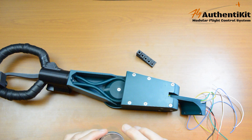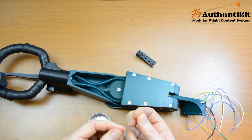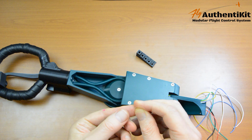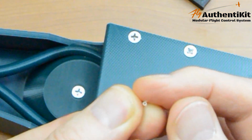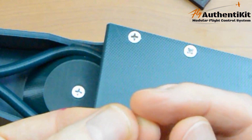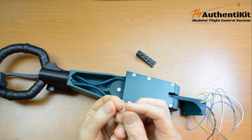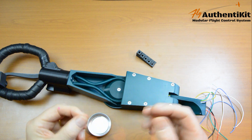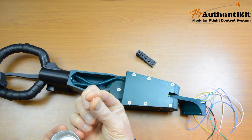That's one thing. Second thing, these tiny little ferrules, they're not all created equal. This is a good one. It's very cleanly cut. I mean, no doubt it's a long tube and they just chop little pieces off. Nice and clean. So when you're threading some wire through there, that's fine, goes great. But depending on where you get them from, I've got another one here which is really quite scrappy.